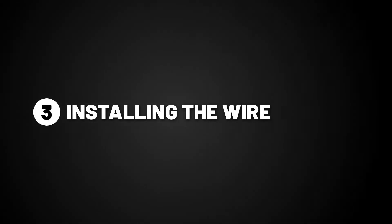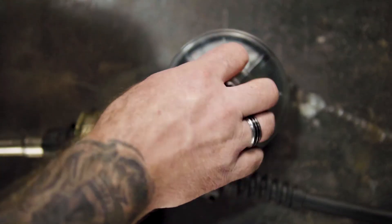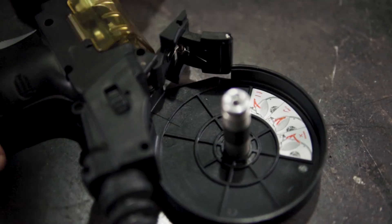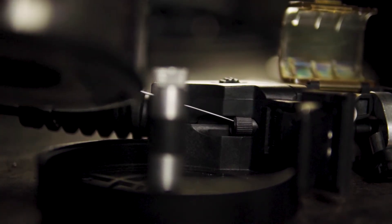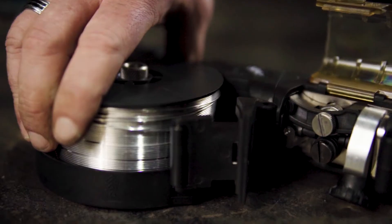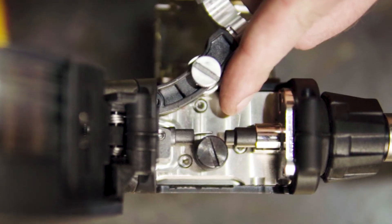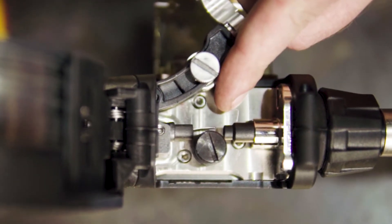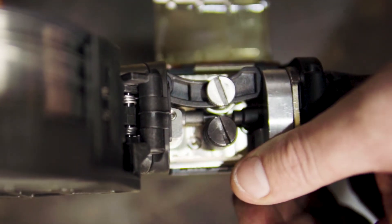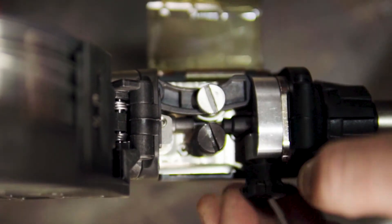Part three: installing the wire. To install the wire, unscrew the housing cover and pull back the brake. Feed around 30mm of wire into the inlet tube and place a spool of wire onto the spindle, releasing the brake onto the wire to ensure the wire does not unravel. Make sure your wire feeds through the inlet, on top of the roller and into the following guide tube. Next, clamp the tensioner arm closed and tighten the tensioner to apply just enough pressure so the wire will feed through.